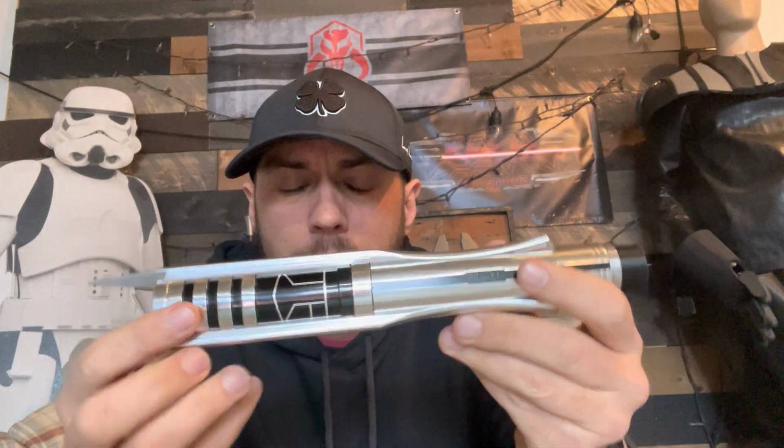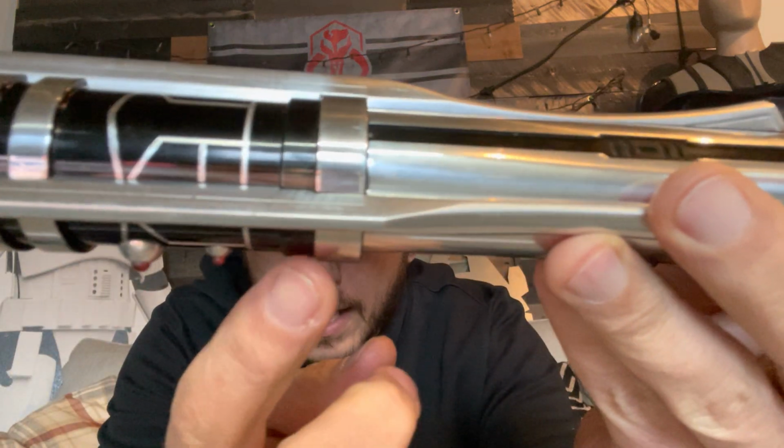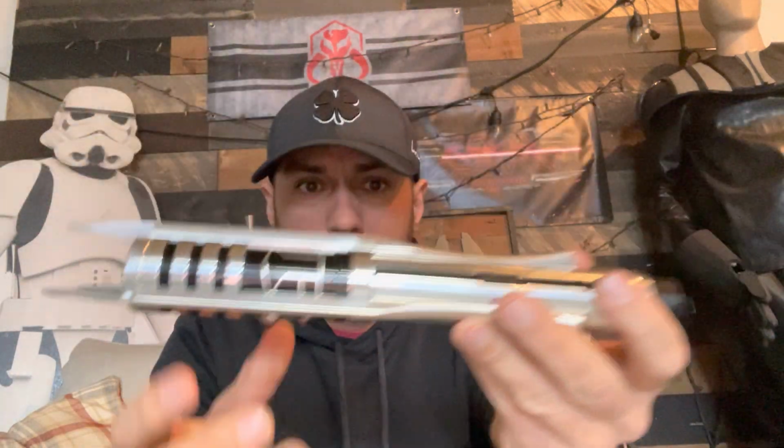First, before you pull it out, you're going to notice that your activation switch has a spring in it, but your auxiliary switch did not. So when inserting the chassis or taking it out, what we first want to do is drop the switches down to the bottom. We want to do that to allow that auxiliary switch to drop down there. And that's important. So you want to remember that.